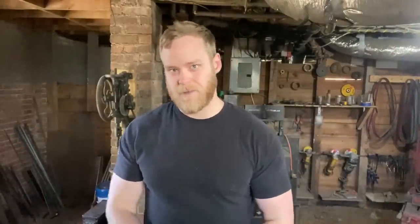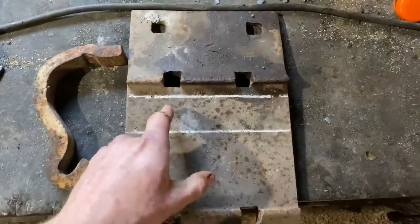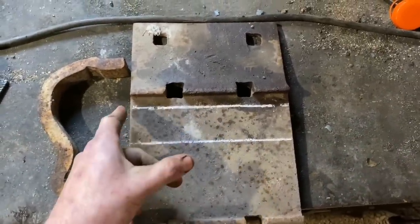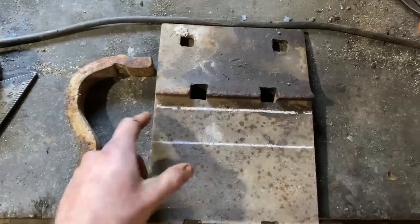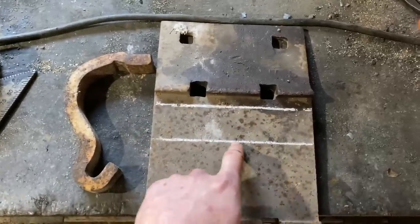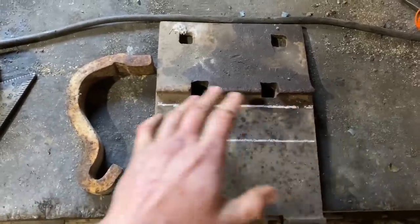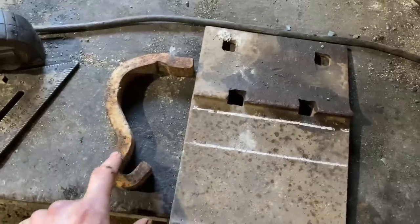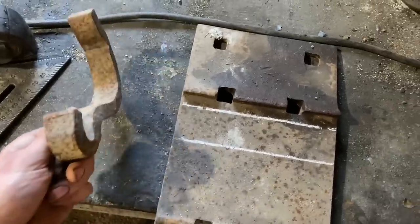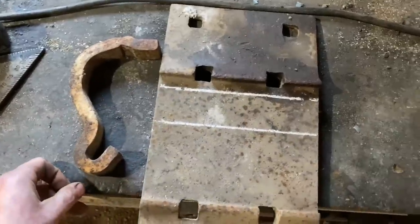If you watch the Black Bear Forge video I put in the description, his starting blank is inch and a half wide by half inch thick by nine inches long. This plate is about three quarters of an inch thick and only eight inches wide, so I'm going to take that material — about an inch and a half wide — and draw it out to half inch thick on the press. We'll draw this spring clip down into about a quarter inch thick bar stock. I'll probably just draw out this whole clip just in case this screws up and I have to start over.